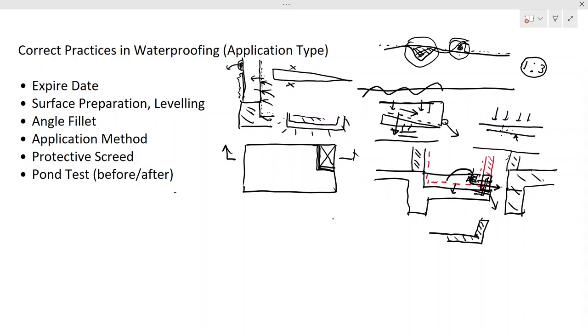Another thing we have to mention here is dampness. Since you are doing the waterproofing, as I explained previously as well, I suggest casting the kerbs. Even if you are having something like this for the bathroom, you might have internal walls in the bathroom. It is good practice to cast a concrete kerb for constructing the dry wall along that. If you have a wall like this, you can cast a concrete kerb. Another thing is, if you are filling the backfill in the concrete, then you might need to cast a kerb there.